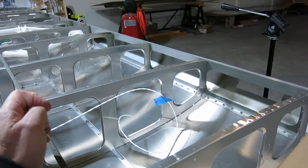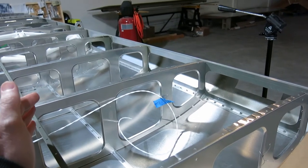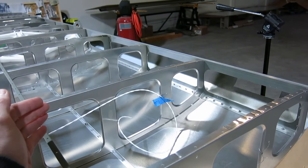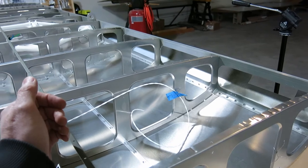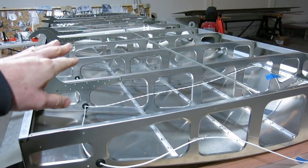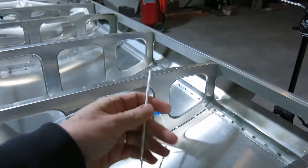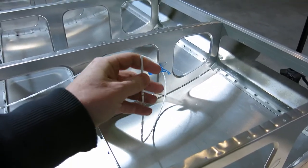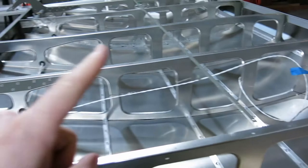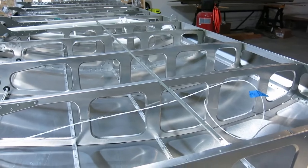cringe on it. So the impression I get from him is that maybe the technology is not all the way there yet, at least not for his comfort level, and he's probably who we're going to have do our panel in the airplane. So I decided to switch back to a standard traditional circuit breaker panel in the airplane. What we have to do now is replace this 2-conductor 18 gauge with a 3-conductor plus a ground wire to go back to the cockpit where the panel is going to be. So we'll get that rewired there.